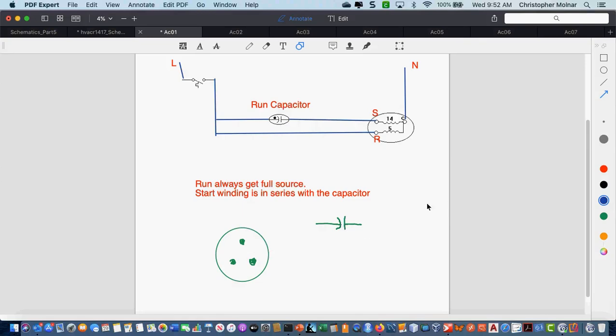So what you're going to do, you take your ohm meter and you take resistance between each of the 3 pins. Okay, so like between these 2 pins, where I'm going to write a number, is 14. And that's 14 ohms. Between these 2 pins is, let's go with the same thing the motor has, let's call it 5 ohms. Okay, so you're taking between the 2 pins. Now, you have a third reading. Okay, that's going to be 19 ohms.